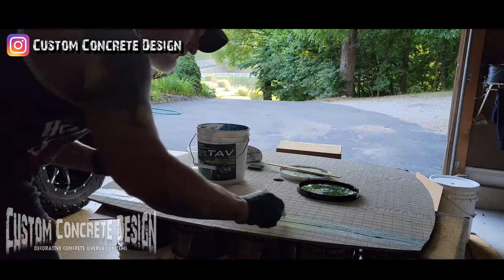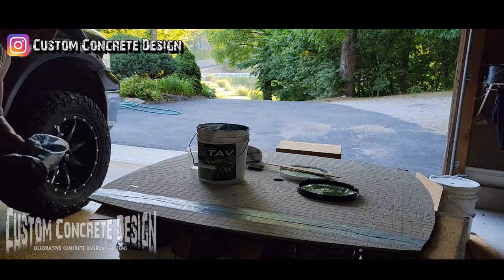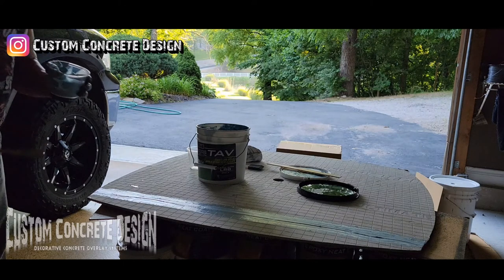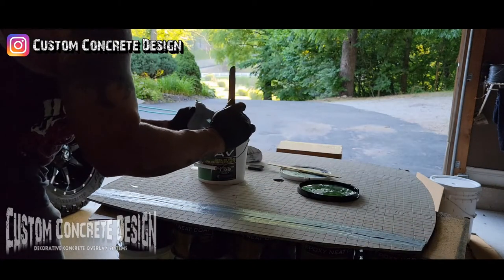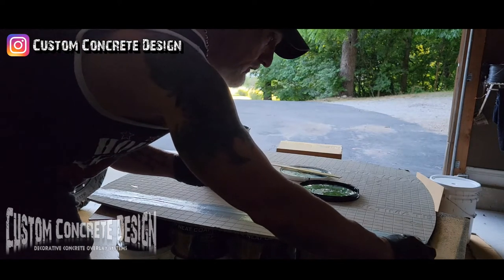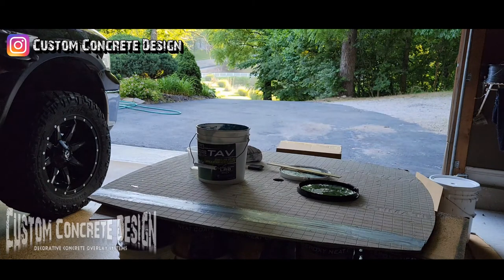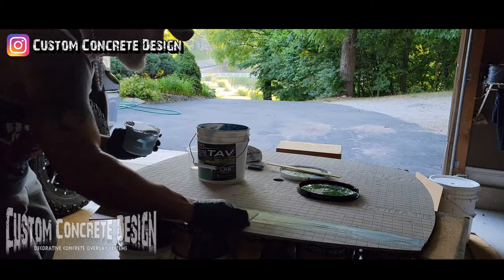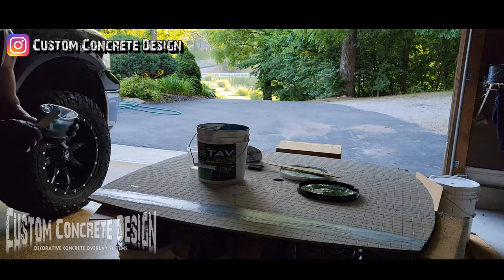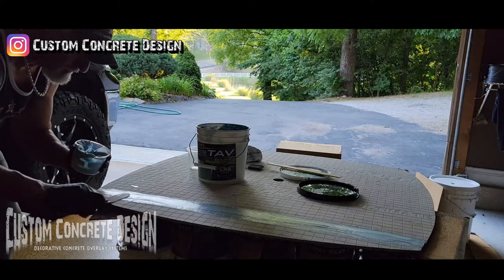Pretty nice. This is the material that we use to put in our concrete cracks whenever we're using Permaflex, or whenever we have fairly large cracks where there's some movement along. We'll use this in those cracks once we get them cleaned out, because we want strength in those cracks so that they stay nice and tight and welded together on both sides with this material.